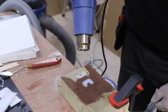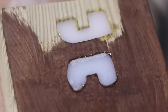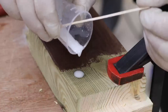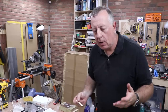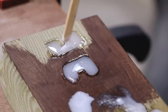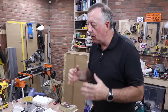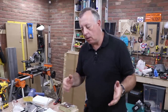Although the heat gun removes the bubbles quite quickly, I left it in place for too long and suddenly I had bubbles coming out of the timber — I can only think it's moisture in the timber grain turning to steam and actually putting bubbles back into the resin, which is exactly the opposite of what I'm trying to achieve. So this little trial is about four hours old now and it's sort of started to cure but it's still really soft and still moving — which means it's going to take at least overnight to get some sort of strength, if not longer. The plan is to do it tonight, leave it overnight, and hopefully I've got some strength to fix the gate tomorrow.